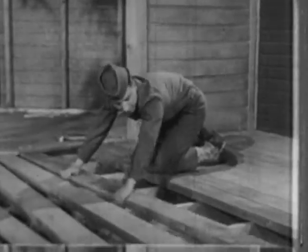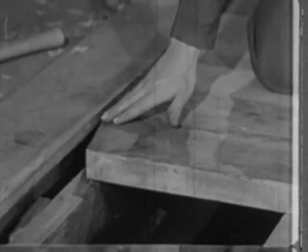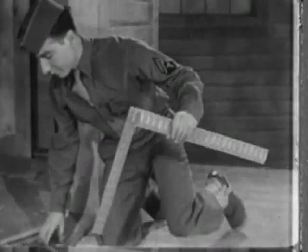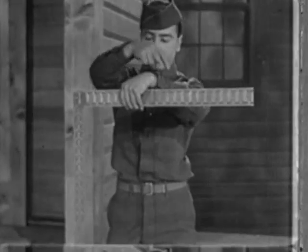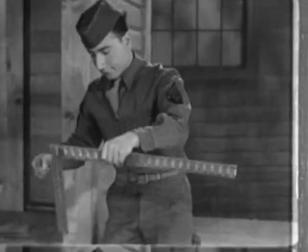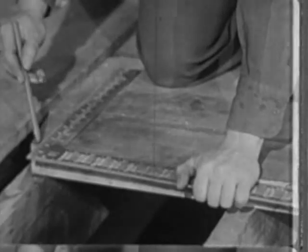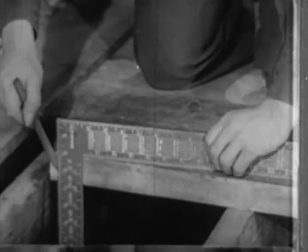Here's a problem where a little knowledge helps a lot. For a clean job, this plank has to be cut off at a true 90-degree angle. Don't let the degrees throw you — they're just another measurement like inches or feet. To square the board, we use another basic tool: the framing square. It's made of two steel sections. The short, narrow section is the tongue, and the other section is the blade, joined at the heel at a right angle, or 90 degrees. To square off a piece of timber, drop the blade slightly and anchor it firmly against the edge of the timber. Make sure the surface is clear of dirt or shavings. Use a carpentry pencil to mark the plank — pencil against the outside of the tongue, flat side against the steel. If you want to extend the line, merely repeat the process from the other edge.